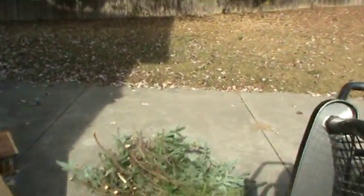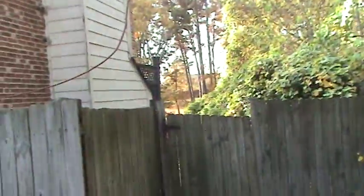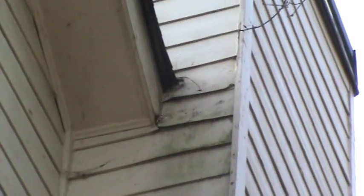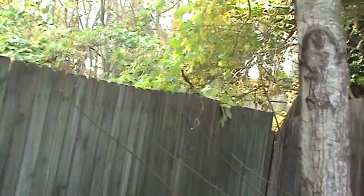This is an aggregate concrete siding. We think it's a Nichiha product — it's not HardiePlank. With some of the concrete siding it's great, but what it'll do is if it gets in areas where it's exposed to water, like up here on the left side of this chimney, you'll see where it's delaminated. It's seven layers of concrete slurry made under pressure into a sheet piece of siding. Those five or six boards right there will just need to be replaced. We use James Hardie HardiePlank product for any of our concrete siding work.